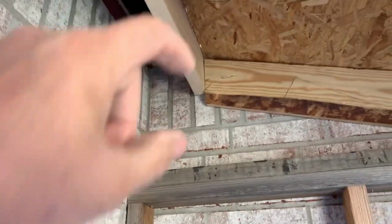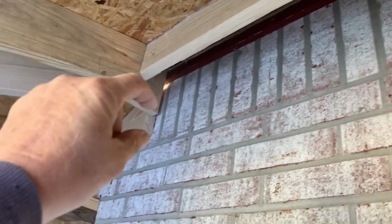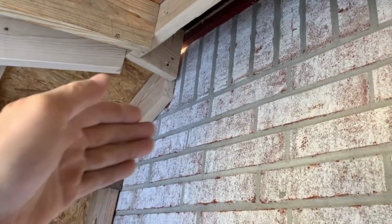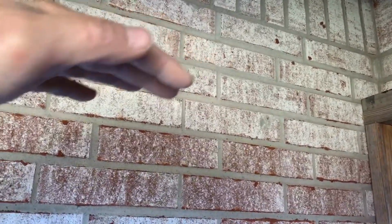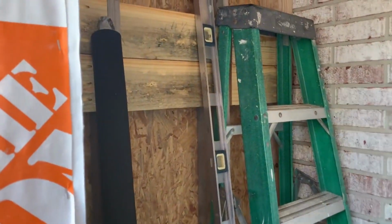Then I want to add a 2x4 across through here and over there, bring it down, and then build a small soffit through this area to the height of this, leave the front open, but finish the bottom. That way I can drill my pipe holes as I need. Because my hot and cold manifold system is going to go right there on the wall. Heater is going on this wall. The water filtration is going on over there.